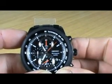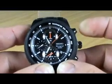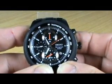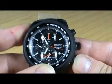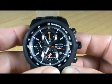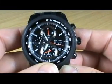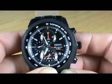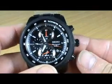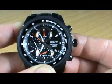It will record split times - you can do a couple of different things rather than just using the stopwatch. For example, you can stop the stopwatch, wait a given preset time - five seconds, ten seconds, hours even - and simply press it again and the chronograph continues. An alternative is split times, where you stop it using the bottom pusher, and it doesn't matter how long you wait - once you press the button again it will go to the time it would have been at if you hadn't stopped it. This is good for split times, relays, and people setting off at different distances and different times. Press the button and the second hand catches up to where it would have been without being stopped - very useful. Stop the chronograph and reset to zero.